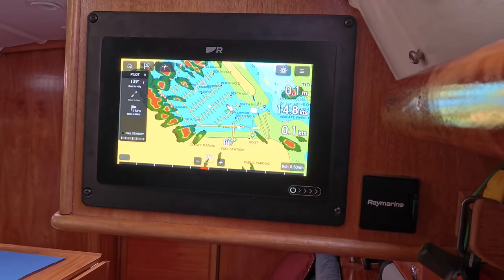The next screen along is a completely uncluttered single-data screen — I've set that up just to show depth. If I'm going somewhere I know but I'm unsure of the depth, it's right in your face so you can see exactly how much water is under your keel. Then finally there's a more minimalistic screen with just the important data I need when anchoring or coming in and out of a marina: depth in the top right, wind direction, wind speed, speed over ground, and rudder angle.